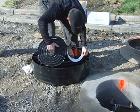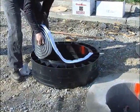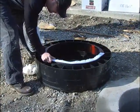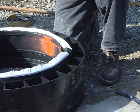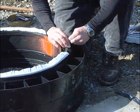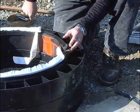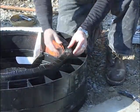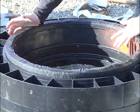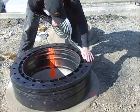If you are vacuum testing the chimney section of your manholes, use the following procedure. For the first ring, place a 1 inch or 1-1/4 inch butyl rope on the flat surface next to the male tongue. Be sure to cut the end rather than pull it apart. Once cut, be sure to knead the two ends together so that you cannot see the splice. For vacuum testing, be sure not to use tube caulk. Be sure to verify that the sealant adheres to the ring. Continue your installation as normal, but again, be sure that you are not using tube caulk.